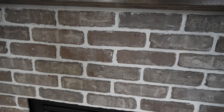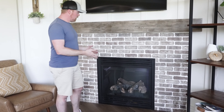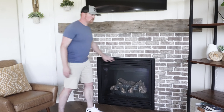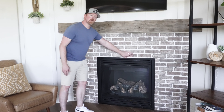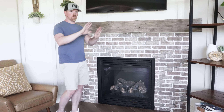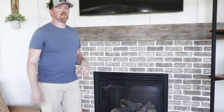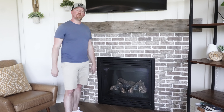We chose white grout because we might paint it — we'll have to see. It went up really well and really quickly as you saw. I left it up here for two days to fully cure. As you can see in the video, we had some pieces of wood used as supports to hold it up and prevent sagging, because the bricks are on mesh and can float and move around on the thinset. I think it turned out really great. Really appreciate you guys watching — stay tuned for more from Gallery 710 for projects, reviews, and DIYs. Catch you on the next one.